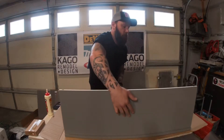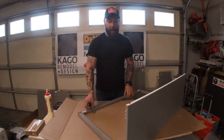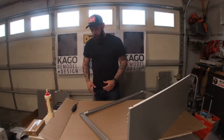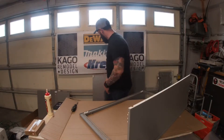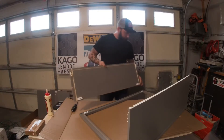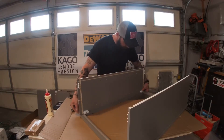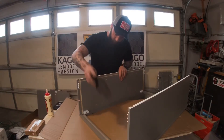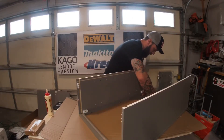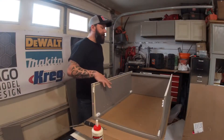Go ahead and lift it up. Try not to slide your face frame over the cardboard — there's always an odd chance something is laying on it that will damage the face frame. Once I've got my second bead of glue run, I'll find my second panel, put it in, make sure it's nice and tight in the groove, and give it a half turn with the screwdriver to lock it in place.